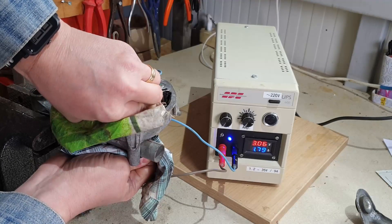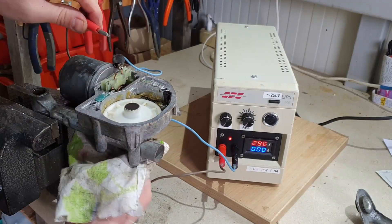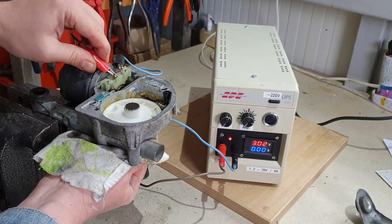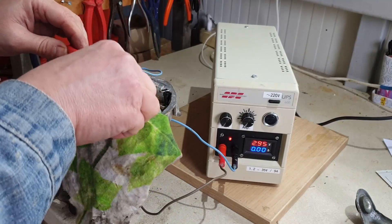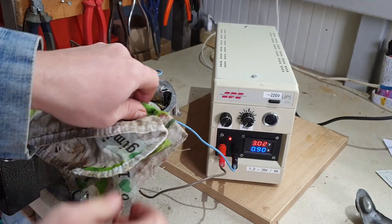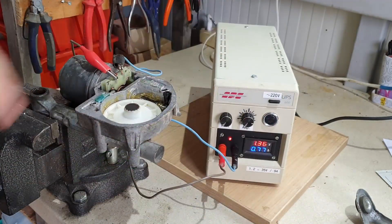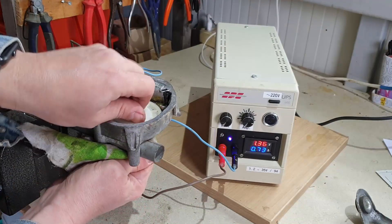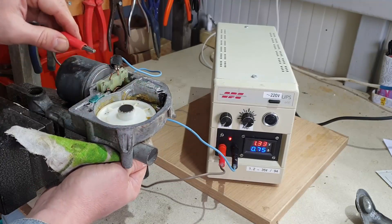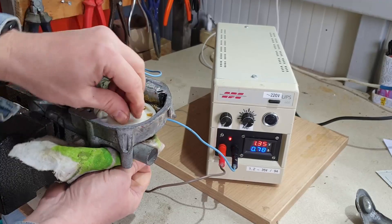I can manage to draw 2A but I can't stop it. Even if I stop the motor and try to start it under load, it starts without problem. Even at 3V it starts under load without problem. I apply a load and drop the voltage to find the stall point — that's the lowest my power supply can go. Even at 1.3V I can't stop the motor, and if I stop it, it has no problem starting again.